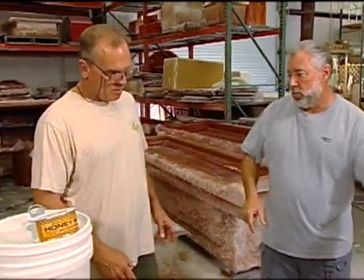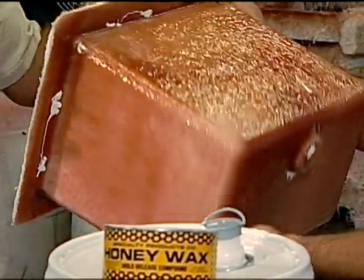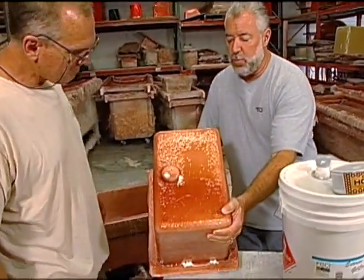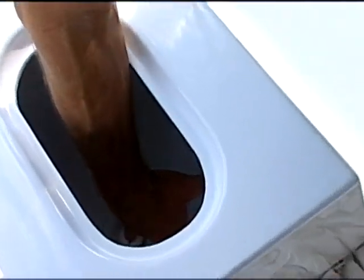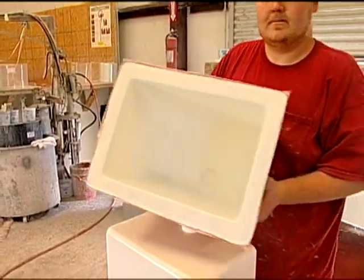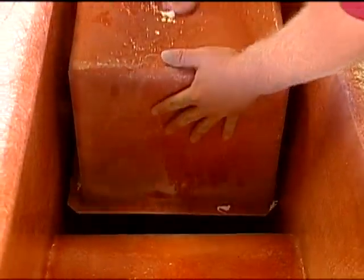What do we have over here, Mark? On our port and starboard seats we wanted to have a cooler built in, so last week I built a quick simple plug and mold to make a cooler for you. Check out this dimple right here — is this going to be a drain? This is going to be your drain, so all the water collects to one spot. We'll put a through hole in there, put a hose on it, and direct that down into the bilge. Are we going to have to trim this and pull it from the mold? Yeah, it's all dry and ready to go — we're going to pull it off, trim it, and fit it so that once we've got our skin coat in — our first coat — we'll have it pre-cut and ready to go down into that area.